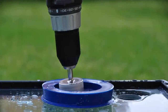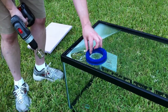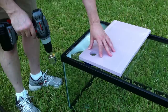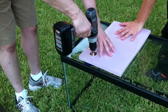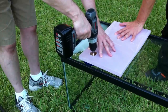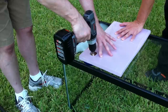Make sure your drill bit is not drilling at an angle — you want it to drill straight up and down. That's why you need a spotter to help make sure you've got it correct. Moving on to the second hole: same principles as before. Add some water, put the template in place, get your helper to hold the template so the drill bit won't wander, and spend about 45 seconds to a minute carving a groove for hole number two. Once that's done, take the template out of the way and continue drilling.